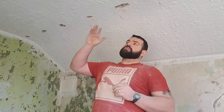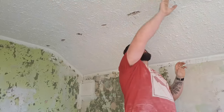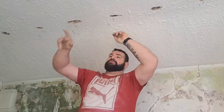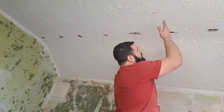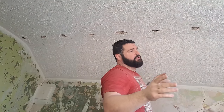Don't assume your joists are going to run straight, especially in older houses. I'd recommend finding them at the other side of the ceiling as well, or just before a slope — it won't be the same joists continuing through. They're usually nailed to the side of them and they do switch sides, so don't assume. Find the joists both sides of the room or just before the slope. Once you've found them, mark them off, chalk line them through, or hold a ruler and put a pencil line across.